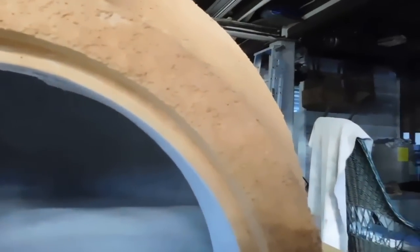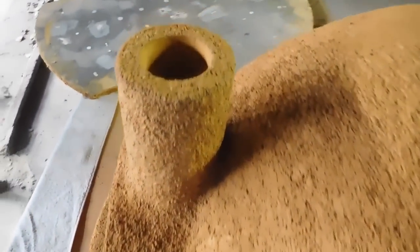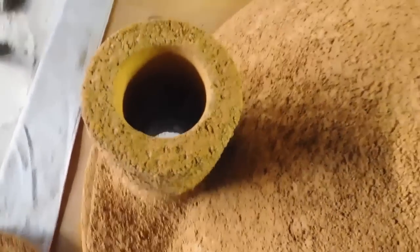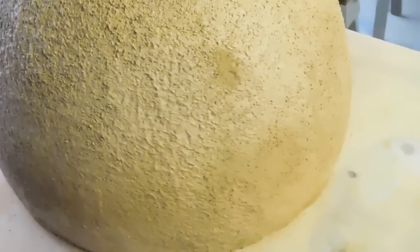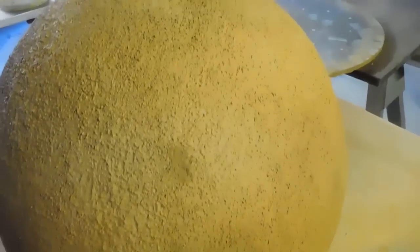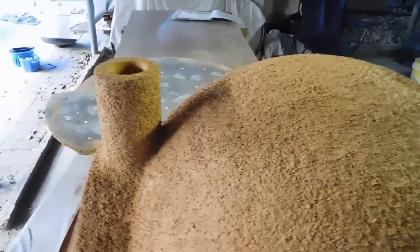which is just a fine pumice mixed with cement and a bit of the oxide. Just have a look around there. Finished off the top of the chimney. Doesn't look too bad. Looks a bit different this side under the fluoro light. Let this cure for about a month, come back and light a small fire and slowly work it in.